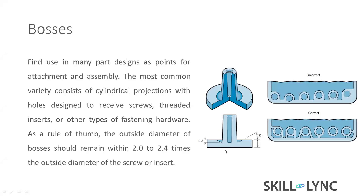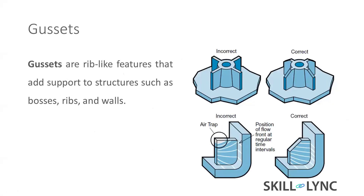We have to maintain even wall thickness in that area. Where chunky material forms, it creates lot of sink marks. So we have to core out that chunky area and keep the wall thickness in a proper way — that will avoid most of the problems.